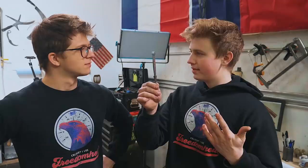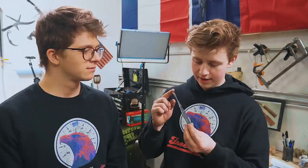The other thing that I need to touch up is the shoulders for the front bolster are a little bit canted forward, which not the end of the world, but we're gonna fix it. Because safe edge file. Safe edge file. Absolutely. But other than that, it's looking really nice. So a good day's work put in on this guy. Looking forward to finishing this thing out.